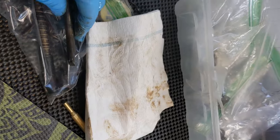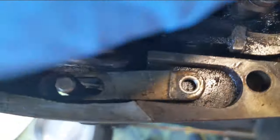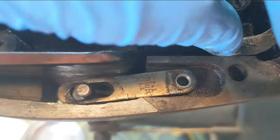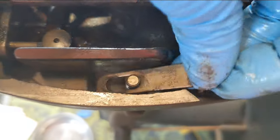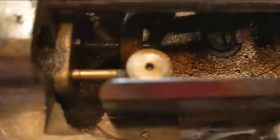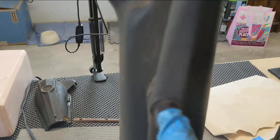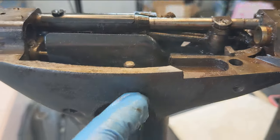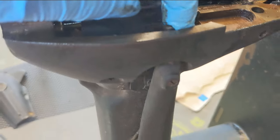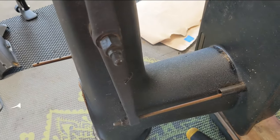Now it looks like there's one last piece that's part of that system, and it's right here. I want to show you the numbers. I'm going to focus on the part number. They're upside down, so when I put this back in, I need to put it in so that those part numbers are upside down. I can lift it out. And that's going to help guide this up and down — that little pin. It's connected to this part, which is this whole lifter lever — to be able to use your knee to lift the lifter lever. That's what that is. And look, now it's moving. So whatever was locked up — I think it was all of the nasty on the bar — it was keeping this part locked up. So it's good to see that that is moving now.